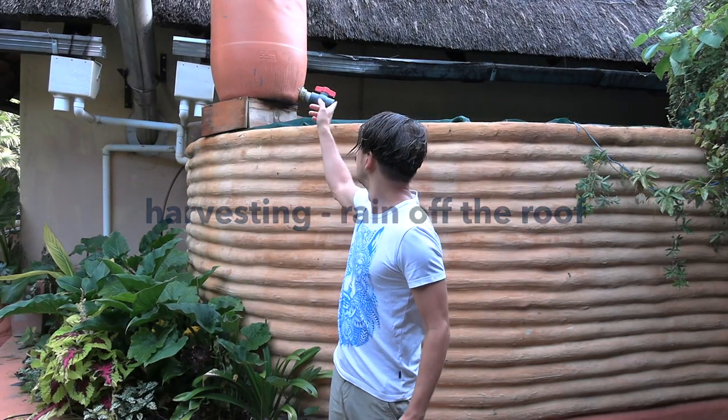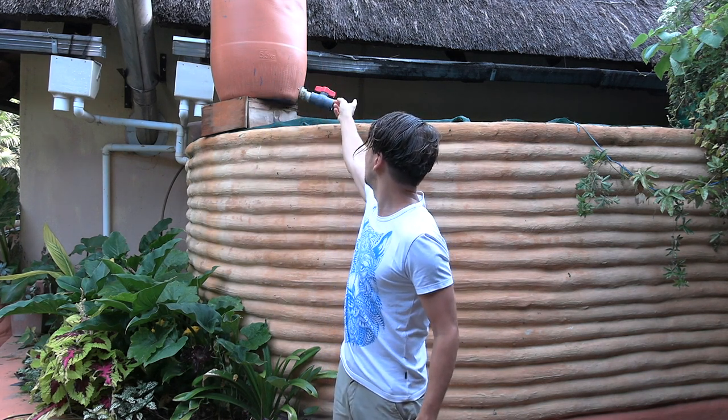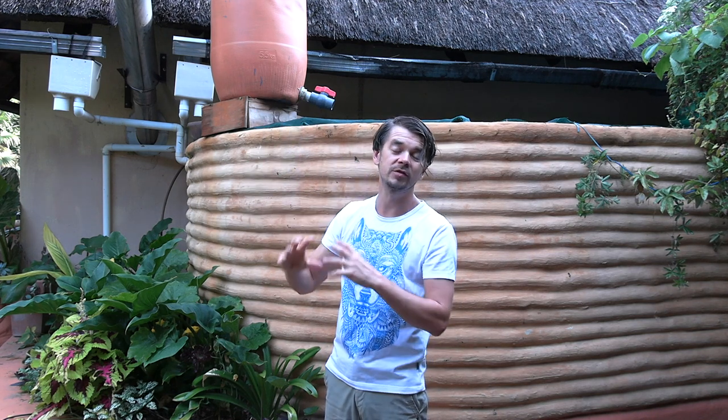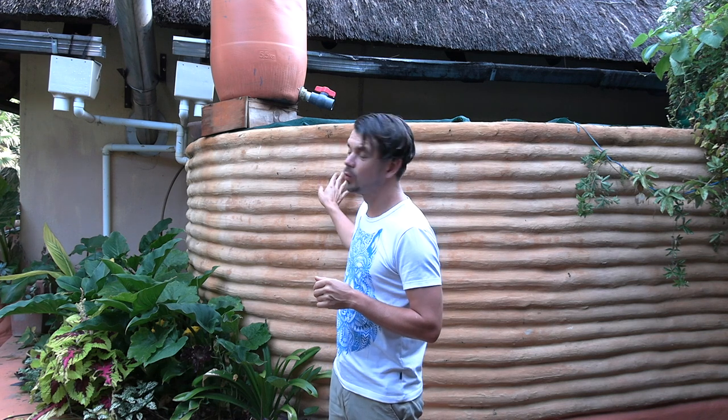Let's talk a little bit about harvesting. We've got the first flush, and behind there you can see the gutter — I'm actually catching water off the grass roof, which is the worst type of roof to catch water because lots of pieces come in. So what I've done is made socks out of shade cloth which I dress the gutters in, and they catch all the bits and pieces — otherwise the gutters are just full of organic material. The water that's collecting is not very good — obviously not suitable for drinking because of the grass roof.